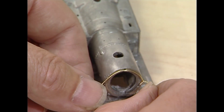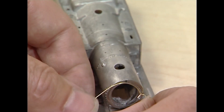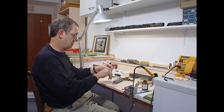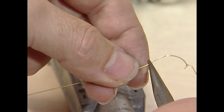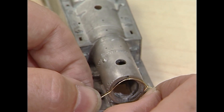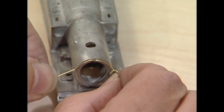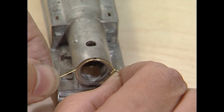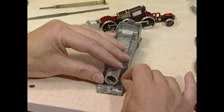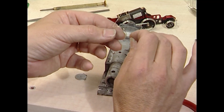That's not too far away now — it's starting to go. We've got to decide where we make our next bend, which is a bit of a reverse curve. You've got to try and remember and nick it with the pliers. Don't nick it all in one go — just make a small mark and try that, because you can go back. It should be visible that it's now pretty much mimicking the shape of the smokebox. It goes in a rising arc, and it's almost a double reverse curve — it kinks one way and then the other.